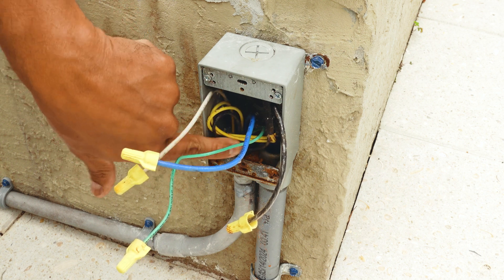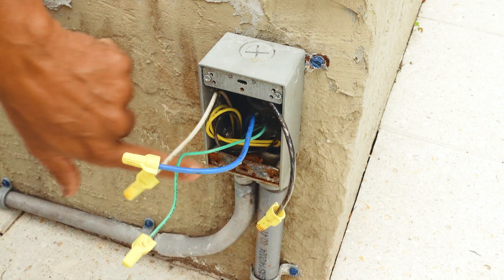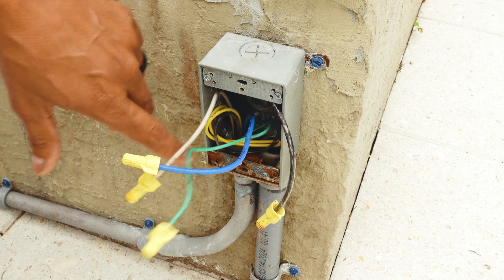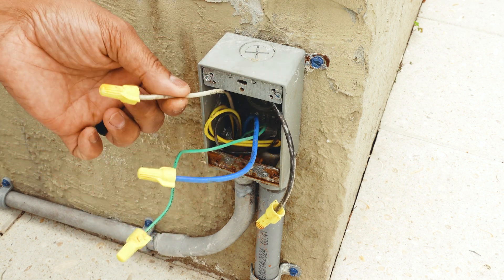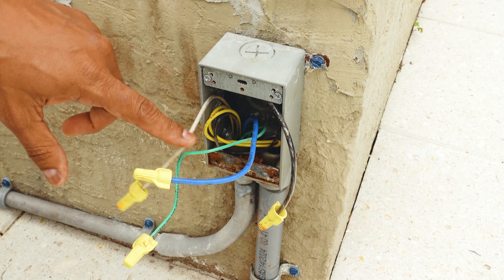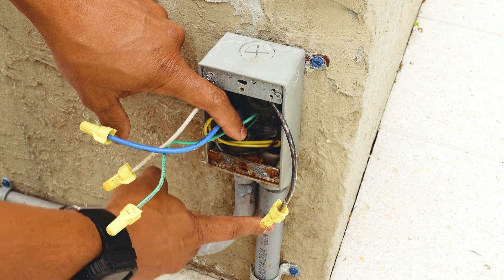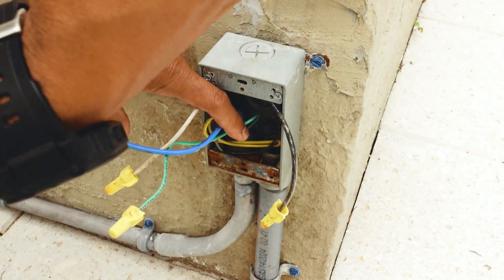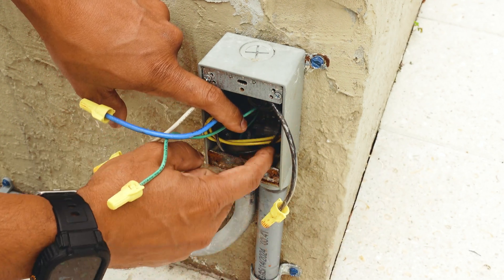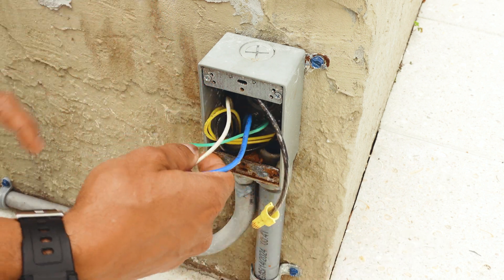You can also see I have two extra wires in here — they're all capped off. Basically it's an extra wire running down this conduit in case I ever need wires in the future. For now they're not connected, so they're dead — don't worry about them. What you're looking for is your neutral, your ground, and your two hot wires. I'm also going to pigtail each of my wires since I plan to run another conduit down to a new box behind my pool in the future.